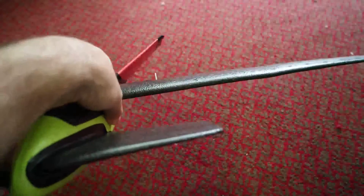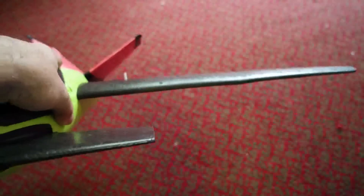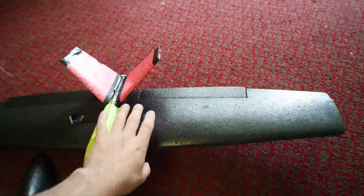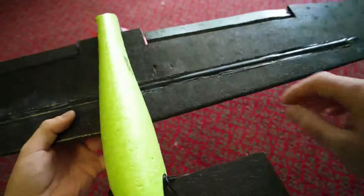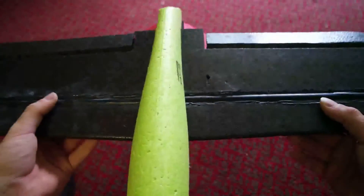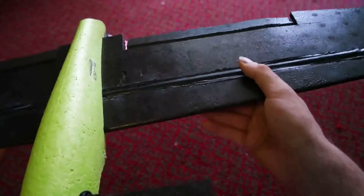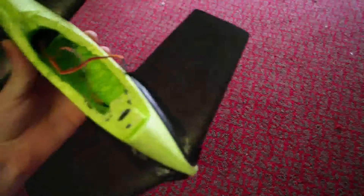The wing, as you can see, we've straightened. I don't think it's all that necessary - straightening it means you'd be fighting to stay level in turns, but it's not going to be really noticeable. In the bottom of the wing I cut out a square-shaped groove and put in my Mini Talon spar. That is really strong - you can't even bend it, so it'll take a lot of G.